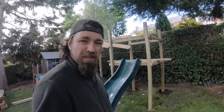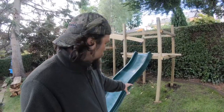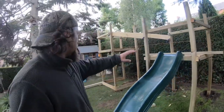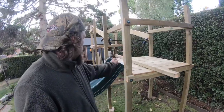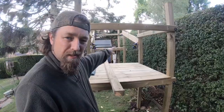I've got the framework back to where I wanted it — positioned, leveled off, marked so I can mark the ground. Happy with everything, everything's square and level. I've got a string line up between the towers as a rough measure and that's pretty good. The top handrails are giving me the distance between the towers.